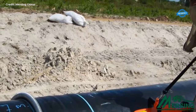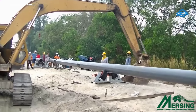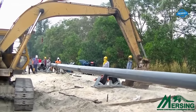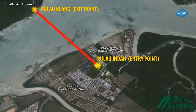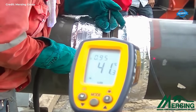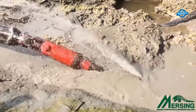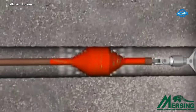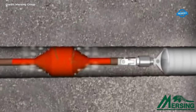The inspected and approved product pipeline is placed onto pipe rollers at a predetermined profile. Due to space constraints, the product pipeline is prepared in two sections, which are jointed together as a golden joint. As the first section is ready for pulling into the final 762 mm borehole, a swivel is installed between the pole reamer and the product pipe to prevent rotation during pulling. The pipe pulling process begins from the entry site and continues until the end of the product pipe reaches the surface.